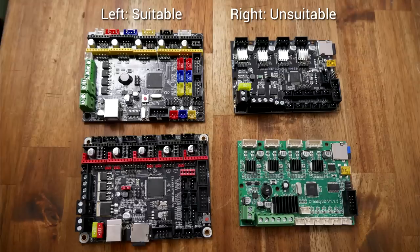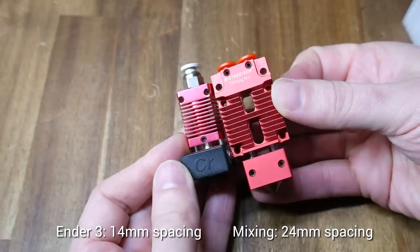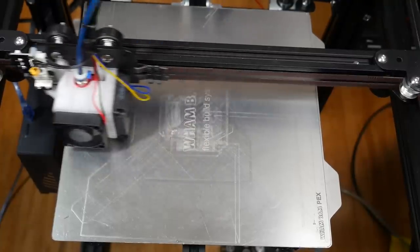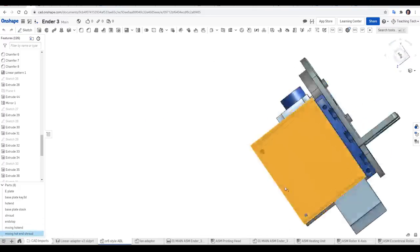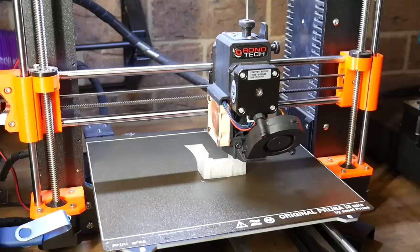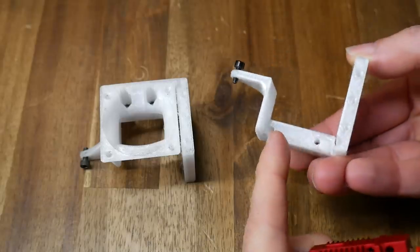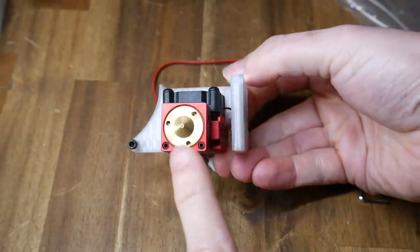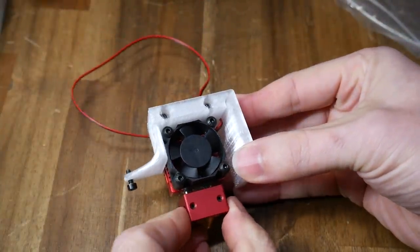With that checklist out of the way, we can proceed with installation. Our biggest problem is going to be mounting the new hotend, as the mounting spacing is 10mm wider than a standard Ender 3. Now on this particular printer, I was already running a custom ABL system modelled on the Creality CR6. Therefore, it was easy for me to clone the shroud, model up a simple version of the new hotend, and then modify the shroud, making it so the two fitted nicely together. I printed this new version in PETG. You can see I added little bosses on the inside to line up with the mixing hotend, and this resulted in a really nice snug fit. I made sure to mount it so I could access all of the grub screws. Just remember that if you choose this hotend, you're going to need some sort of printed adapter.